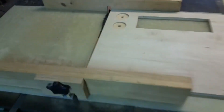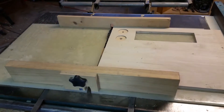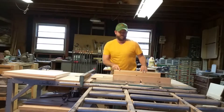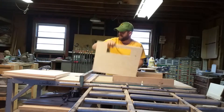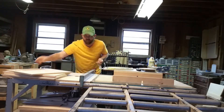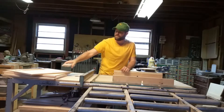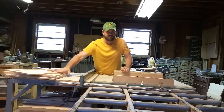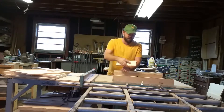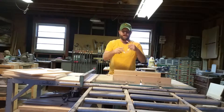So that is my setup. I'll go ahead and record the way I test with some scrap, and then we'll get started making the finger joints. I'm set up, I have my dado blade at the correct height, and I'm going to grab a couple pieces that are the same thickness as the mirror box that I'm cutting.